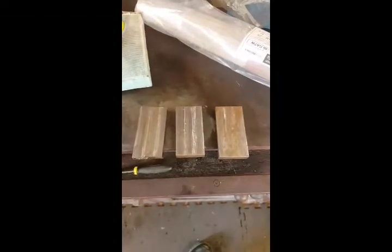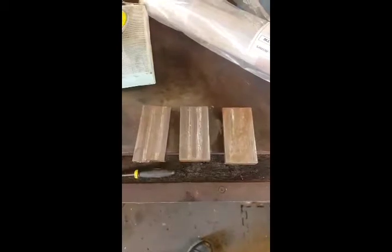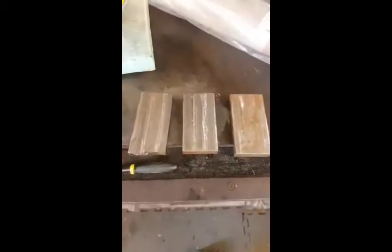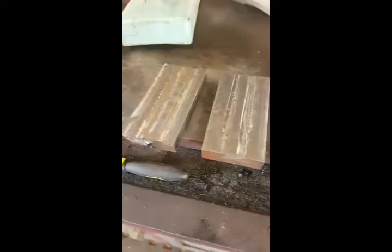Hello all. So recently I've decided to start work on the crankshaft simply because I'm getting a bit bored of plate work on the tender and I fancy something a bit more mechanical. As you can see here I've got three of the four webs — I cut these out of half inch steel sheet with an angle grinder and then squared them off in the milling machine.